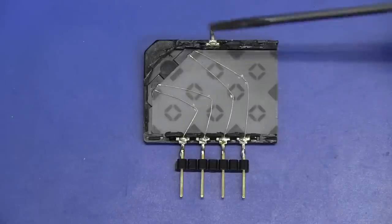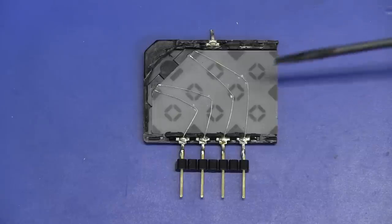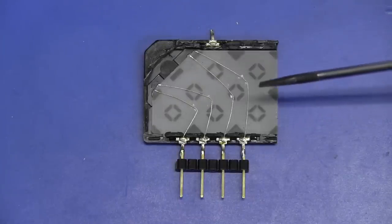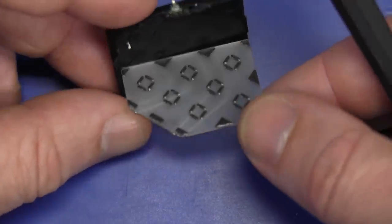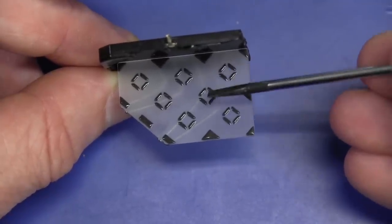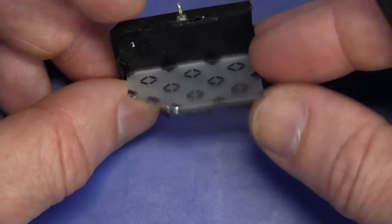As it turns out, these things are typically either a quartz glass or a potassium lead silicate glass. The thickness of this glass will be basically one wavelength, so it effectively works as a waveguide. And this black stuff on the back of the glass — I did guess correctly last time — it is actually an epoxy compound, which just dampens the glass a bit in that particular location and helps guide the shear waves through the glass.